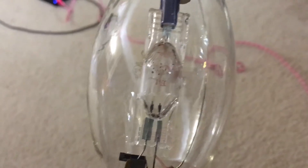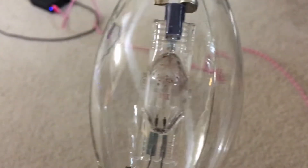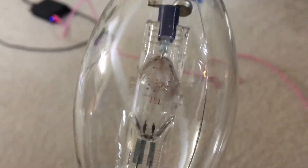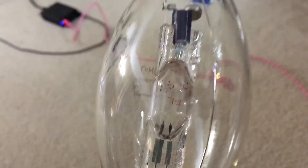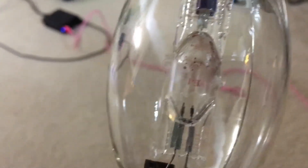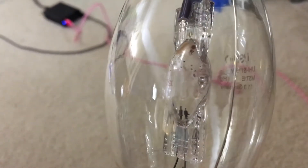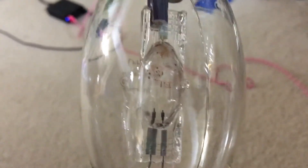Let me give you some specifications. This blue metal halide bulb produces 3,900 lumens — a very low output, probably because the arc tube only contains iodine, mercury, and argon. The average lifetime is 6,000 hours, which is still pretty good and slightly longer than my 400-watt green metal halide lamp. The burning position is universal according to ushio.com. I'll put the rest of the specifications in the description below.